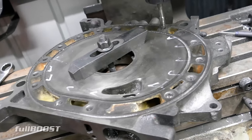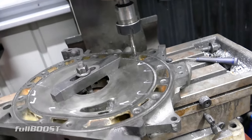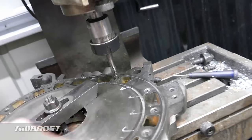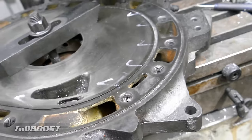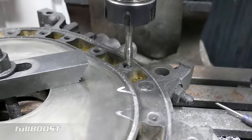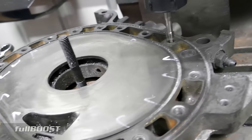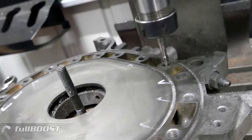The mill makes it a bit easier than a drill press, but you can still do it. My two main tools for this are essentially these. The thread in here is M10 by 1.0 — a very, very fine thread. What I've got is a tap, and I'll move the machine head down into position. This isn't bolted down — it's not clamped in place. You can see it's actually moved the plate over to where it wants to be. It's threaded in there, picking up the plate, so I know it is perfectly locked on in that thread, meaning the whole column is completely centred on that hole.